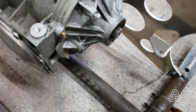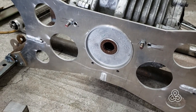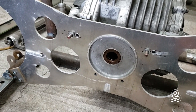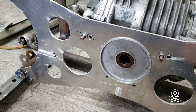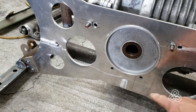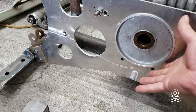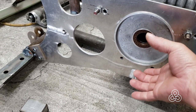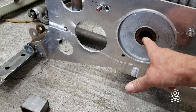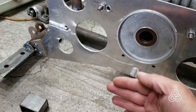The bottom and upper are going to be adjustable for all of our suspension geometry. Now on the back side — another problem, somehow in the measurement of this thing. I checked it to see if it was because of the flip, but it was not. It was just somehow I got the measurements wrong. So I had to redo the holes to get that lined up. This conveniently comes with long studs here, and these bottom holes are not threaded but will clear through, allowing me to add longer bolts because there's going to be another casting I'm going to do — that will connect to the drive shaft coming out of our transfer case. The transfer case is set up so the output is in direct line with this, but we're going to have to cast a piece to adapt to the transfer case.